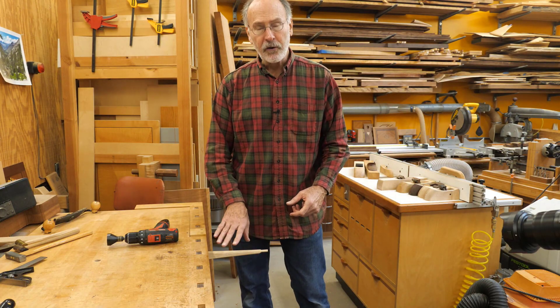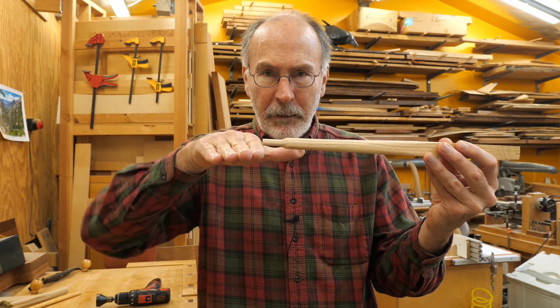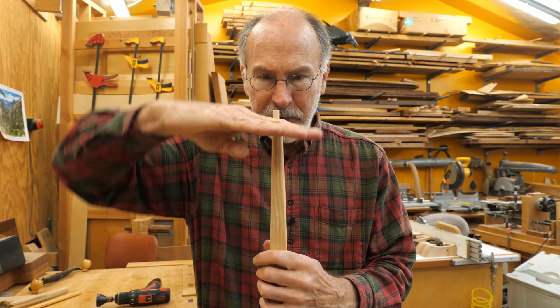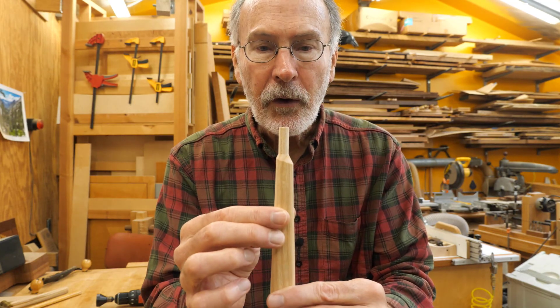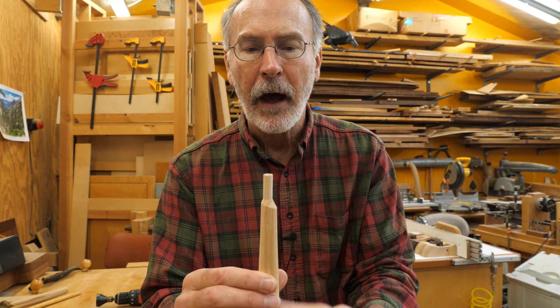You just go until the cutter stops cutting. That went pretty well, though my wife said I dropped a little bit. One thing I should have pointed out: I had the handle in the vise so the oval is horizontal, because you can live with a little bit of misalignment side to side. When you're using the hammer, you're not really going to notice if it's slightly crooked that way, but what you definitely don't want is it misaligned up and down — you don't want to be hammering and have the head pointing up or down. I also notice I'm pretty asymmetric here, so I'm going to put this back in the vise and use the spokeshave to take some material off one side and straighten that up.